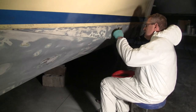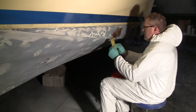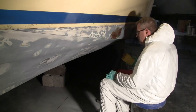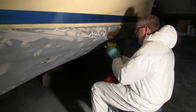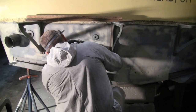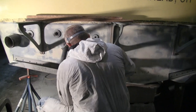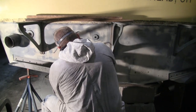Quick glimpse of what it looks like — looks like a pile of dog dew on a plate there, but it is what it is. I use a plastic spatula, basically a plastic putty knife, to fill in all the low spots and make sure we've got the void filled 100%, no air bubbles trapped in there. The stuff does shrink a little bit as it dries. So you can either try to lay it on thick and then you're left with the battle of trying to sand it down to the right height, or you can just lay it in there, wipe it down flat — it will shrink when it dries — and then you end up cleaning it up and filling again. That's kind of the process you have to go through to get it right.